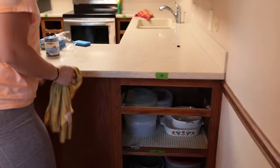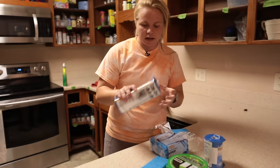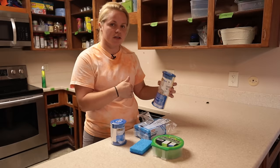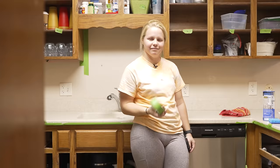That's some dirty water, and just to think that the water is dirty only from the outsides and framework of the cabinets — not even including the doors. That is a prime reason why we need to clean before we're ready to paint. So technically we're ready to paint but we do need to cover the area. I've got some different sizes of the blue scotch tape with the plastic that comes attached to it, and then I've also got some frog tape to tape off the walls and areas where I don't want to get any paint. Let's get started.